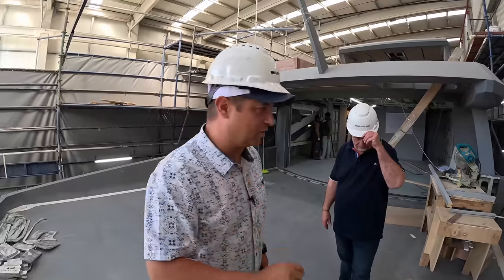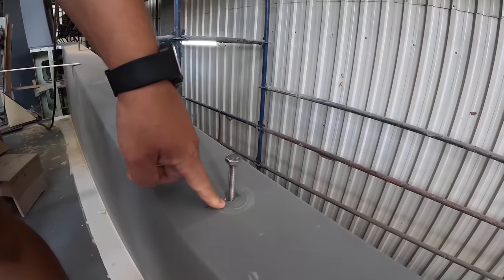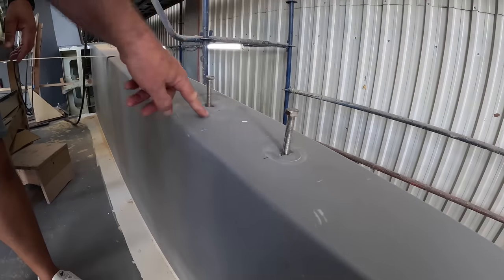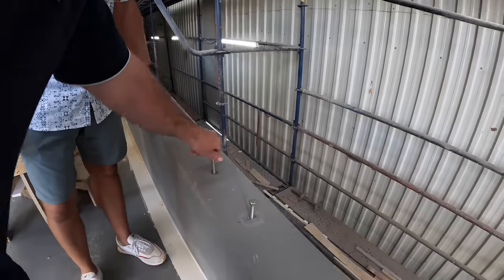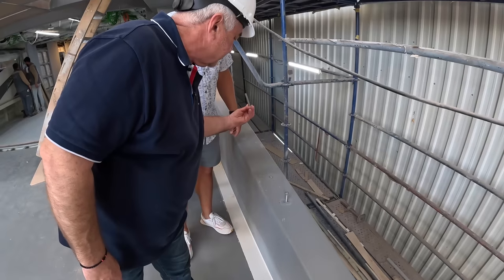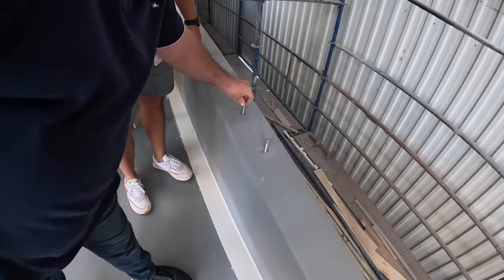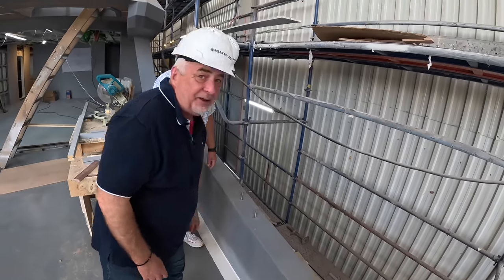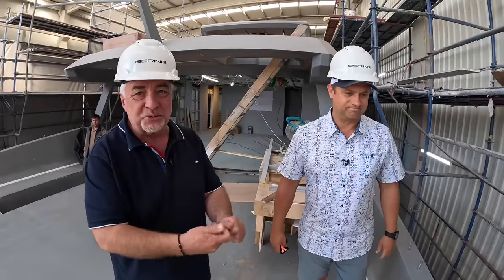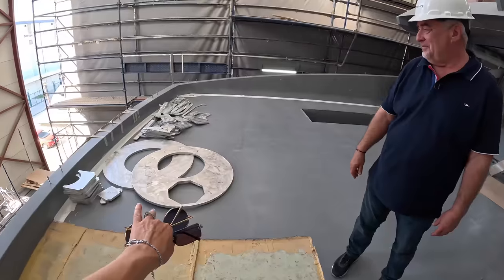First it's a bedding or adhesive, then it's Sikaflex. And look at all this — you put the thread in here. It's for the railing: it's a stainless steel 316 bolt and a steel plate which we saw on our own boat. They're about 10 mm thick, and you put a stainless steel bolt through the stainless steel thread for the railings, so you'll never have rusty rings around them — which some people apparently love to scrub with a toothbrush.